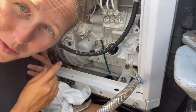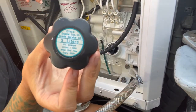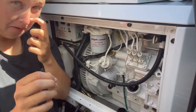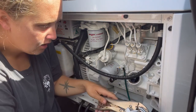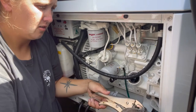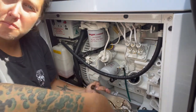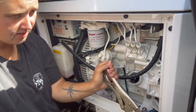See if I can keep that up while I put the oil in the engine. So I've got 3 liters to put in. Is it right there on the cap? 3 liters. I guess we'll finish and make sure I've pumped everything out. Okay, finish this up. Just disconnecting the oil pump hose, then topping the oil up and checking the level, which involves just running it enough to get the oil filter full, and then call it a day.